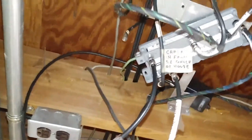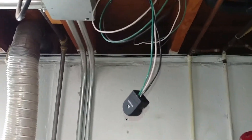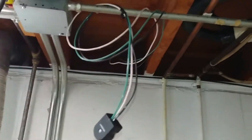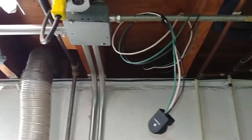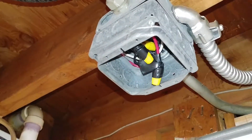There's a mess of cabling for TV and stuff, but that's not really a big deal. This here powers a string of outside sockets that run along the back wall of the house. This was plugged into this outlet — I unplugged it because it just didn't feel safe to have wiring like this plugged into an open outlet. Also, one of the outlet covers is missing outside. So I have an open junction box here, all live, with no cover on it.